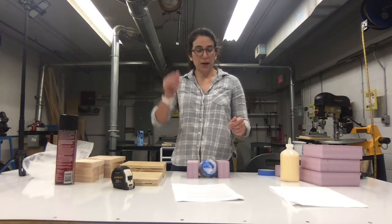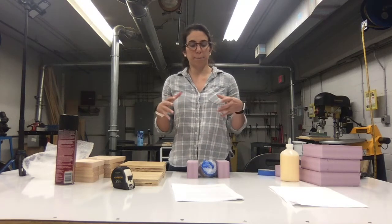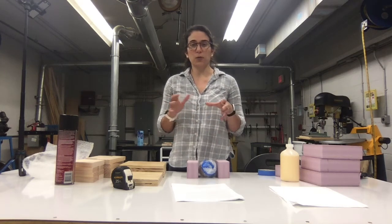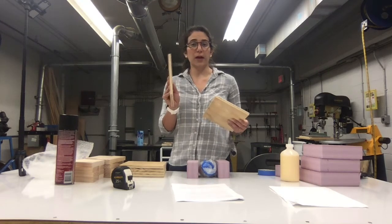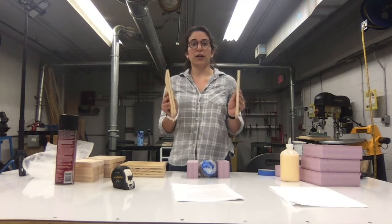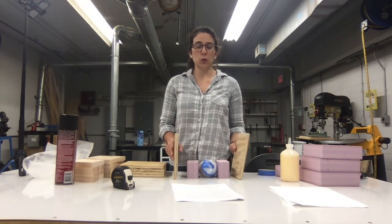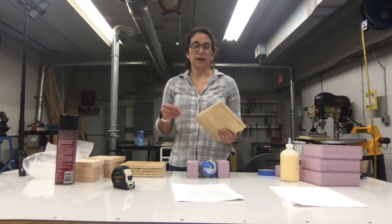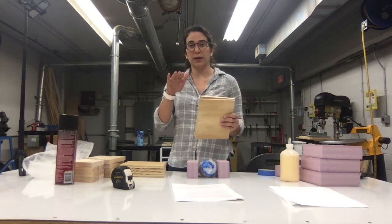So by that, to put together the box, we need to do a butt joint, so that will make us include the thickness of the plywood, which is 3/4. So 2 sides make 1.5 inches. Okay? So now we know that we need 2 pieces 8 by 8. Then we need another 2 pieces 8 by 9.5. And then the bottom and the top needs to be 9.5 by 9.5. Okay?